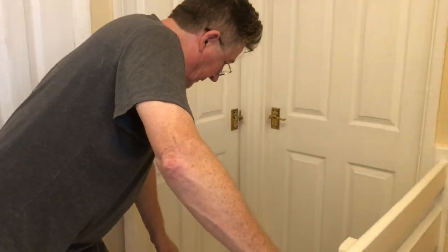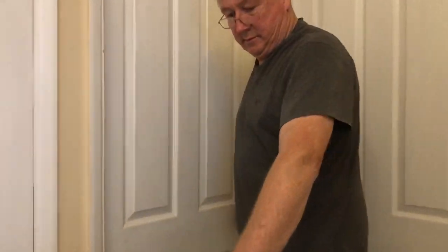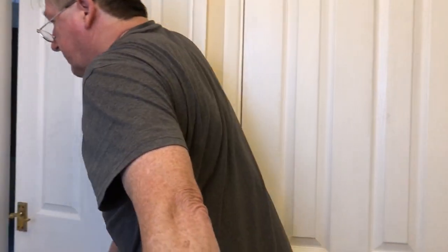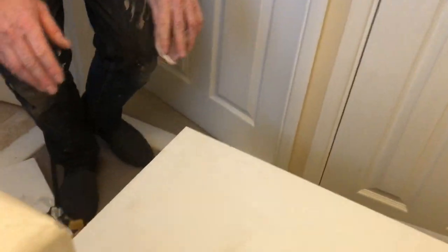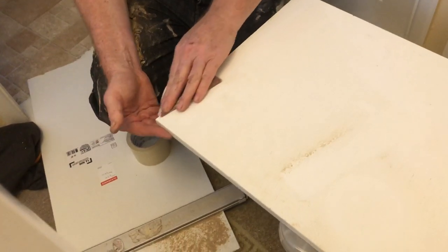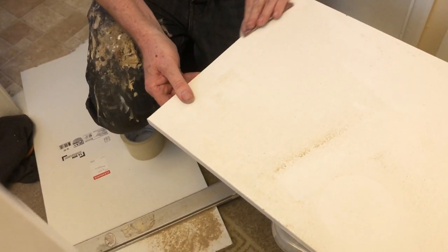You can also get a fine tooth blade for your circular saw, which we've actually used when we've cut IKEA cabinet fronts and that works really, really well — no chipping whatsoever. If you watch our videos you'll see we fitted an IKEA kitchen with gloss front cabinets. I'm only using a standard blade here, but even with sandpaper you can see that improves the look already.